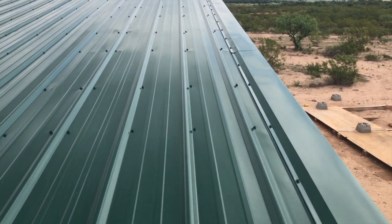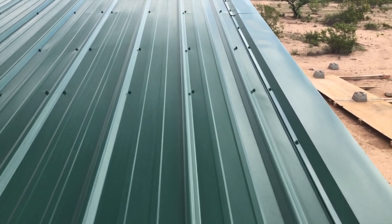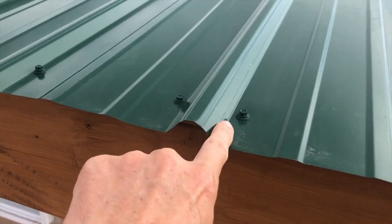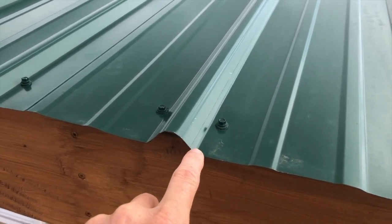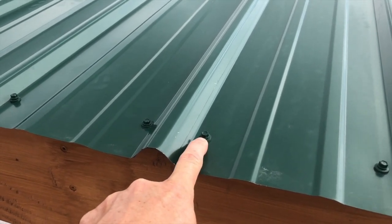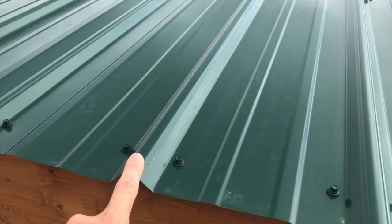It was kind of a random choice, at least we thought. So Bill turned to me and said, "Well, which side do you want to hit?" And I said, "Oh, let's go with the right." And it turns out that was a minor mistake, because as you go across the panel and you get to where it overlaps the next panel, I don't know if you can see this, but the overlap is right here, and one of the pieces has a little extra kind of foot to it, maybe. It's actually under here going this way, and one doesn't, it just stops right here. So because I chose the right side, when we did this screw, we weren't actually catching this other panel that overlaps it. So we should have chosen this side. By the time we realized that, it was a little too late.